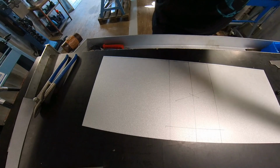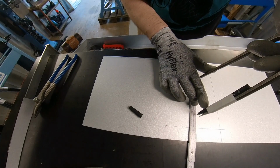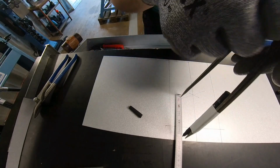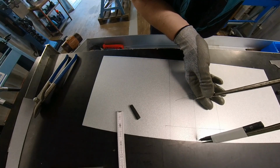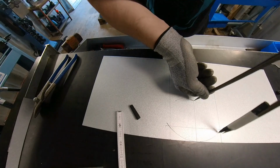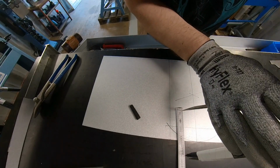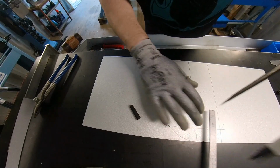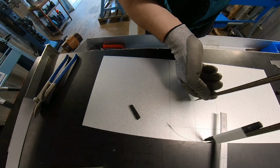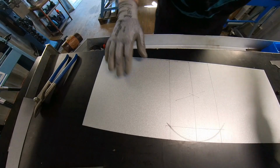That means 102 millimeters I need. So I'm having here 1 plus 10 is 11 and 2 millimeters. Okay. So now I'm gonna hold it on this line here. Yeah, it's more because it isn't exactly 100 because of the swage allowance. So if I do exactly 100, you will see here now, it's just about the swage allowance, nothing more. Okay, now this is my part, what I'm gonna need.